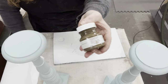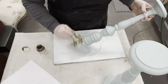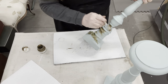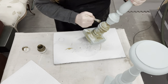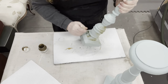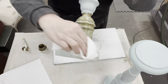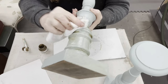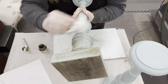As much as I love Waverly's Antiquing Wax, which is always very brown and dark, I also love Fusion's Antiquing Glaze — two different products. The Fusion glaze is actually a lot more liquidy than the wax. Just like with any wax, you wipe it on and then wipe it off. It's not as thick, it's more watery, and it has a slightly longer dry time, but it sticks in those crevices and gives amazing age to a piece.